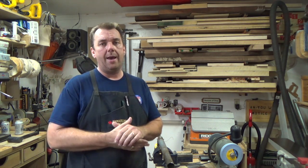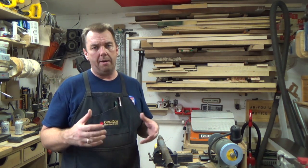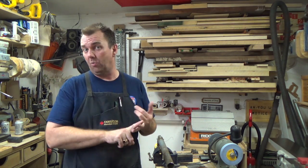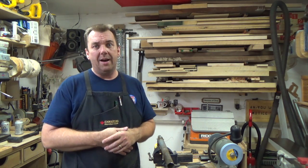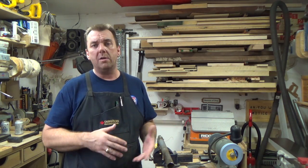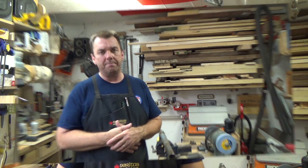It does help to have a second set of hands manning the spray bottle to apply water to the rag and to the wood whenever it gets too dry. And I'd like to thank my wife for coming out to the shop for that. But other than that, absolutely awesome. Let those forms sit now overnight or longer until you're positive that that wood is completely dry, and they should hold their shape just fine.